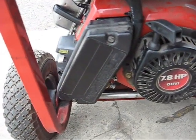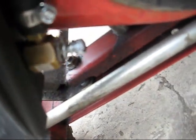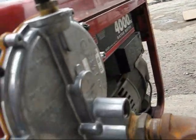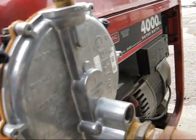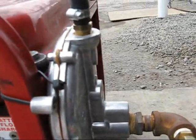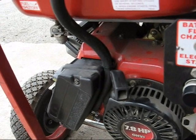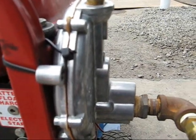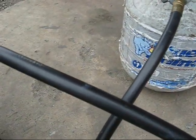I'll put the air filter and the baffle back on, and we'll get ready to run. I put the air filter and the air cleaner cover back in. Here's the end of the spud-in, and you can see the screw for adjusting the fuel mixture. The hose for the propane goes up and over the frame into this. And this is the key to every propane conversion — the demand regulator, or sometimes called the KN regulator. What this does is it senses the vacuum that's being drawn by the engine and adjusts the fuel flow accordingly. When the engine's off, it shuts off the flow of fuel.